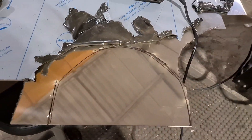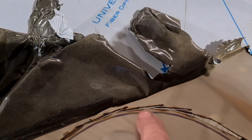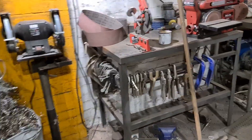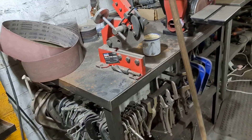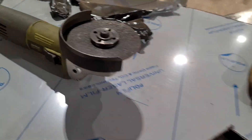It's worth a mention - look at the shine on that reflection. I go in with a cutting slitting saw and cut into it following around - it gives a zigzag, which is not the best, it's nasty when trimming off the sheet. But then I go over to my little guillotine and trim round to that marker-penned line.